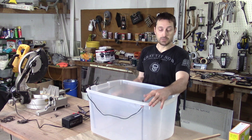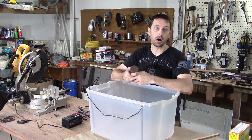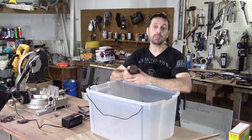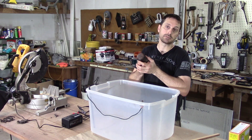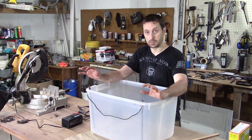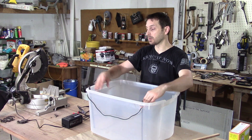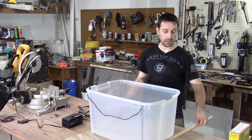You do not want to use copper wire on your part itself because it will cause some nasty corrosion, and because copper itself will conduct the rust and particles pulling off the steel — they're going to attach to the copper. So we have this copper wire kept near the top of the tub and we're not going to let it touch the water. We're going to fill the water to just about an inch below where those wires come in to connect the electrodes.